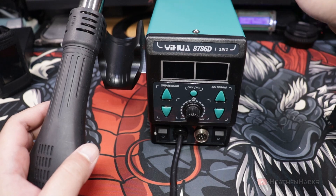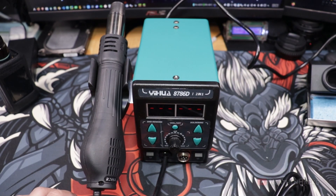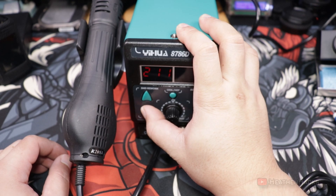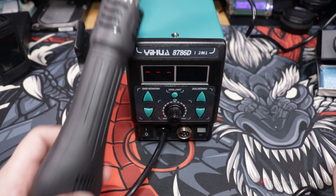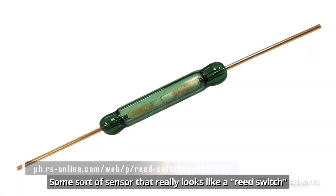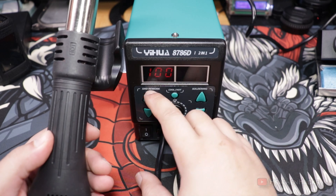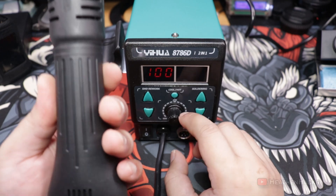I've already plugged this in to a power source. Oh — this is magnetic, eh? Well, not actually magnetic, but more on that later. Let's power this on. Upon turning on the control unit, the LED displays blink like this if either the heat gun or soldering iron are turned off or in standby mode. Let's turn on the heat gun — it's already set to 350 degrees Celsius. Let's lower it to about 100. Since this is magnetic, I assume that it also acts as a switch. The heat gun's switch is turned on. The LED is displaying blank, but if we lift this up, it should automatically turn on — and it does. As you can see on the PCB, there's some sort of sensor that looks like a reed switch, connected to this PCB which is connected to ground and handle. On the heat gun's holder, we have two magnets on the left and right side. Once the heat gun is turned on and the temperature switch is on hot mode, it turns on the heater and slowly ramps up until it reaches the desired temperature. This knob controls the volume or speed of air that the heat gun is outputting.